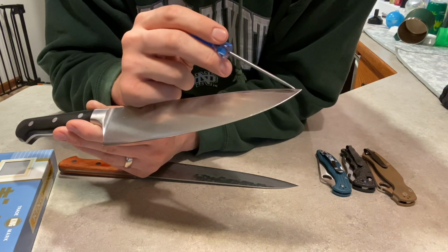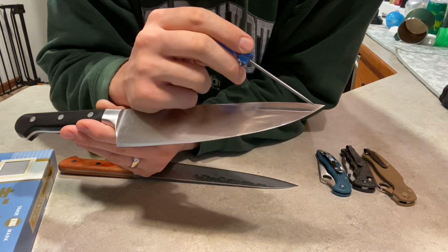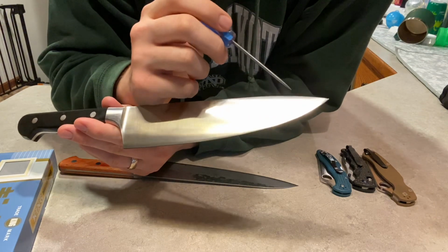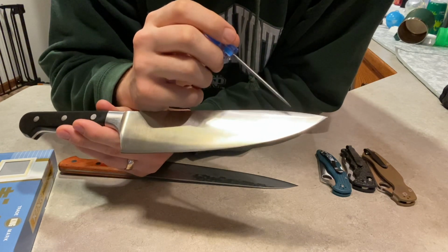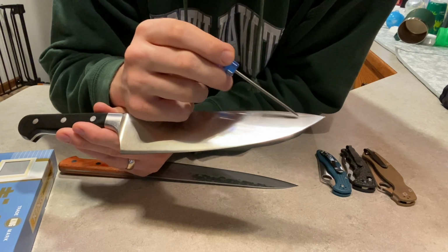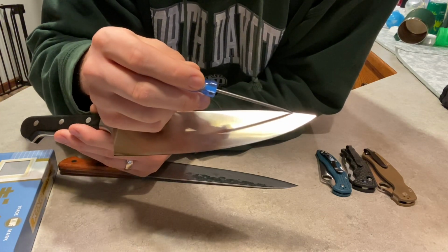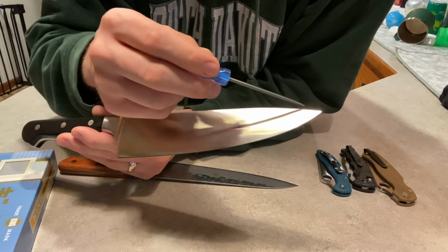On a lot of knives, it can be different. The very tip tends to be a little bit thinner than, say, back here, but the difference between here and here is not that great at all. So the best option is to come from there to there. Not only that, when you do this sort of a thing, unless you want it to look like a Santoku, where it's very aggressively coming down from the spine, which I'm guessing you don't, you really have to blend that back. And so you're gonna be coming kind of farish back on this to get a smooth transition, right?